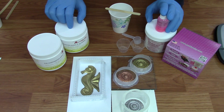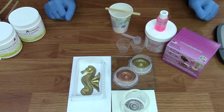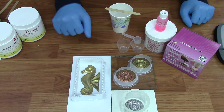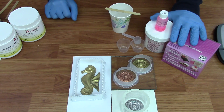Today we're going to be showing you how to mix the ten to one versions because the one to one versions are pretty self-explanatory. Before you begin, you want to make sure that all of your originals are sealed up in their mold boxes and ready to go. It does help to have an extra mold available so that if you have excess silicone remaining after your mix, you can always pour it over that item and add to it later if necessary — that way you don't waste any silicone.